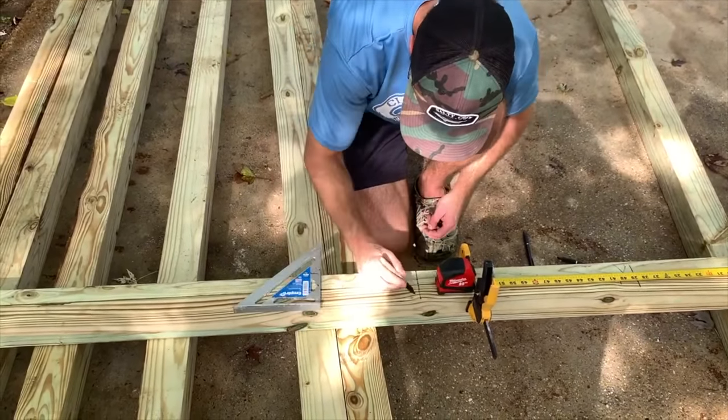As you can see there, it's actually in pretty good shape. And there's that line, so we'll line it up there. And then we have our overhang, and we'll hit it. If we take a look from the inside of the model, you can see that we have 1/2-inch overhang around the entire edge of the window. This 1/2-inch overhang is gonna provide a surface that we can push our window panels into and that it can mount against.